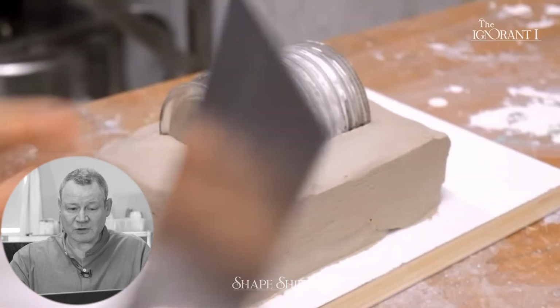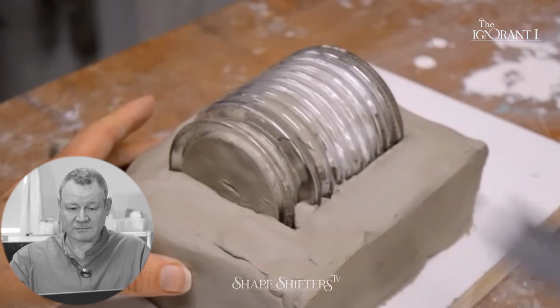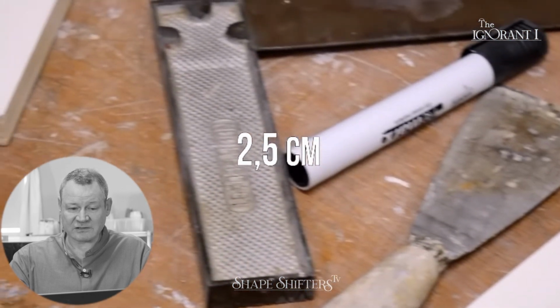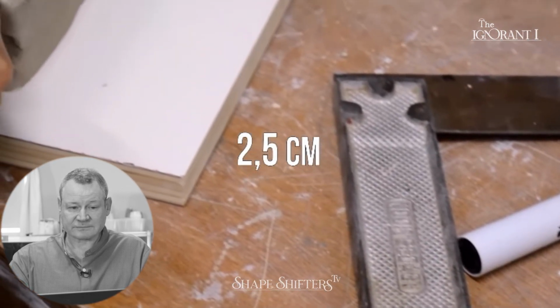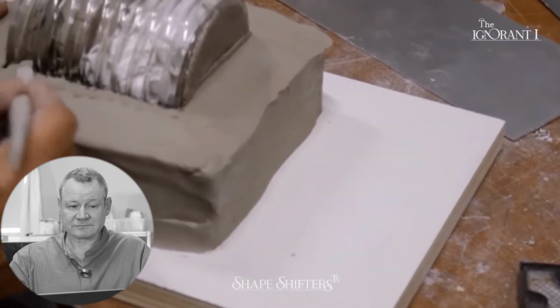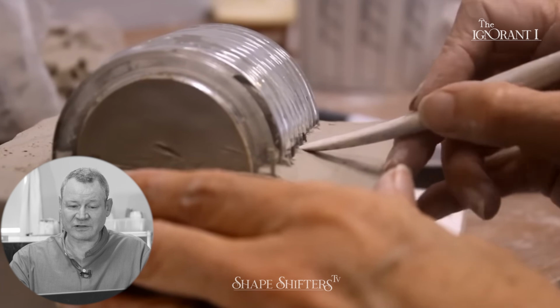Okay, so that took her a while. She'll clean this up, I hope. The clay bed should be flat and smooth. Mm-hmm. Good. Measuring. Nice. But make sure that you leave at least 2 centimeters, about an inch, free around the model to pour the plaster. Glass shapes are really tricky. I mean, they look easy, but they're tricky.